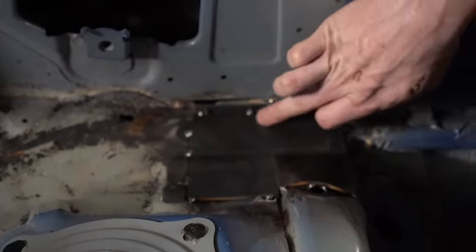We're almost done with our base plates. We just need to do one more plate on the strut tower, because with this cage, we're actually going through the firewall to the tower as per the Champcar rules. This is going to allow us to make this chassis as rigid as possible without adding any points against this car specifically. They allow for an eight point roll cage and tying in both strut towers.